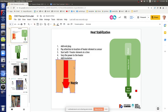If you have insulation with any kind of R value, R value refers to how much you're slowing the heat transfer down. If you've got pretty much immediate contact, immediate transfer through metal, as long as you're insulating it, the outside temperature should be the inside temperature on a metal. It's fast. One side of the metal versus the other, like a pot on the stove. If you put a flame to it, it'll get pretty hot on the other side pretty quickly, depending on the sea of electrons, the conduction of the metal. For less conducting things like stone or rock wool or brick, it takes a bit of time, but metals are quite conducting. So if you're insulating, you can make a fair assumption that the temperature on the outside is going to be quite close to the inside temperature.